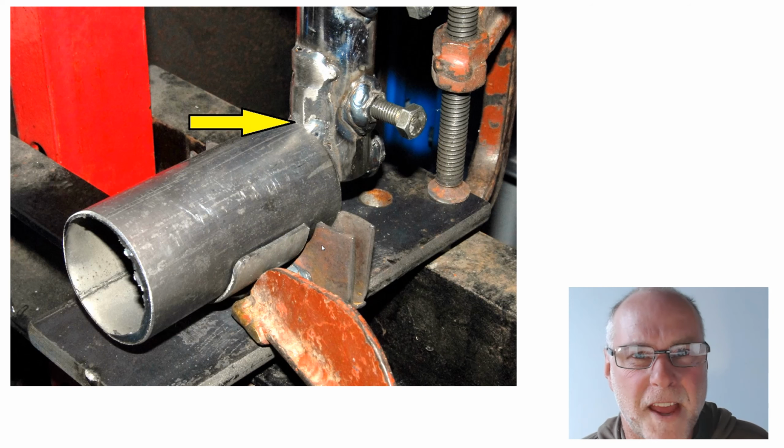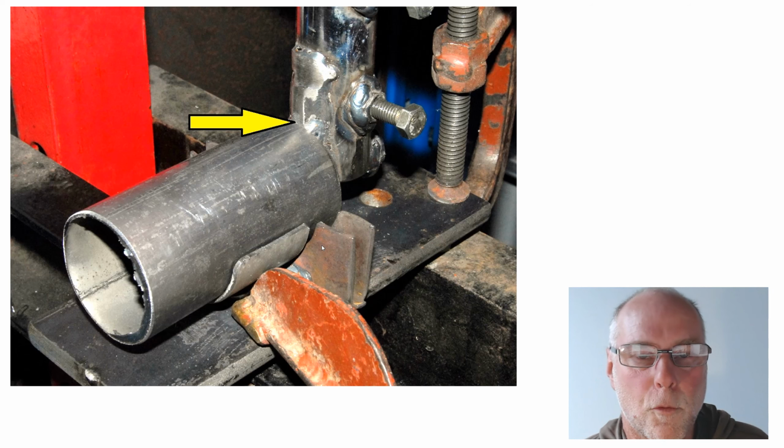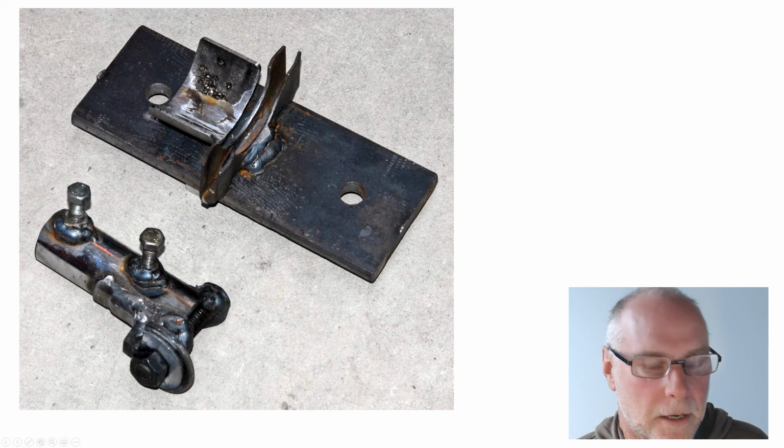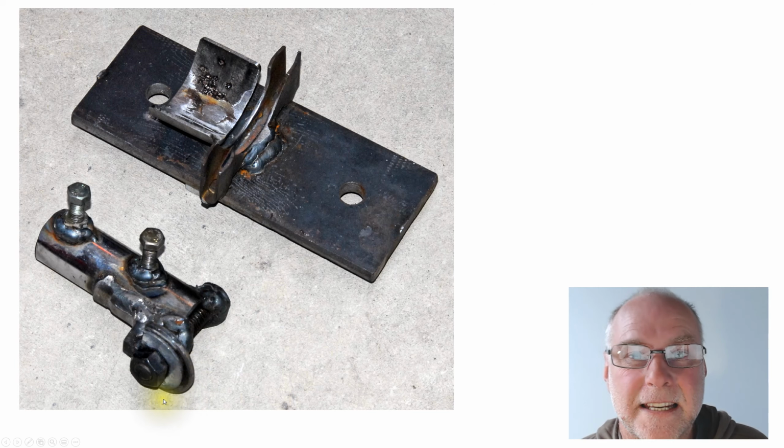Now, you wouldn't want to do thousands of tubes like this, but typically on a car you're working on at home, you might have 5 or 6 beads of this sort to produce, so it doesn't matter if it takes a few minutes to form each of the beads. So here's the two tools. Here's the base plate, there's the muffler clamp, there's the slightly open guide that allows us to put the tube in at right angles, and here's the device that does all the pushing. And of course the bead is formed by that being pushed into the inner side of the tube.